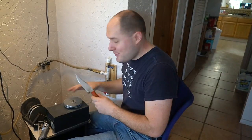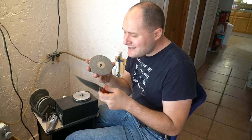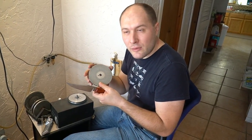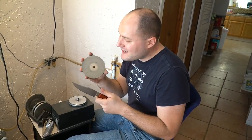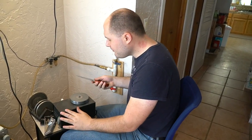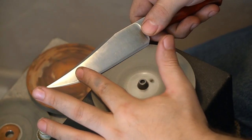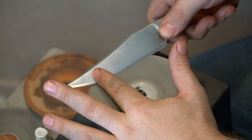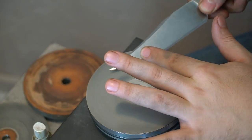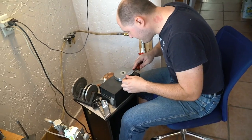This is what I use to sharpen pretty much all of my knives. You can use a stone, but this makes it a little bit easier. This is a diamond-coated wheel for sharpening engraving chisels — it's kind of worn out but it works really well for knives. It's got artificial man-made diamonds on it, spins at a real low RPM, and I hold the blade at about a 22-degree angle and just start going at it. You can see a light little sharpening line on there — now come at it from the other side.